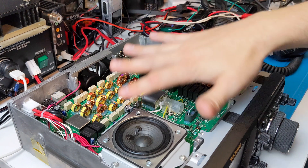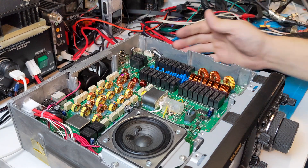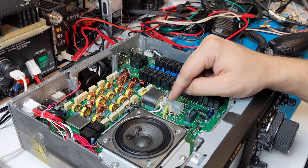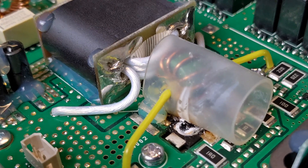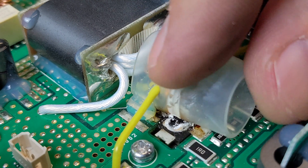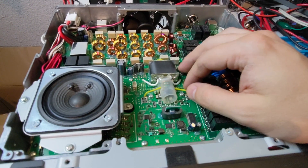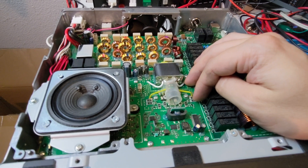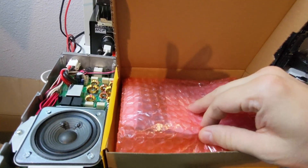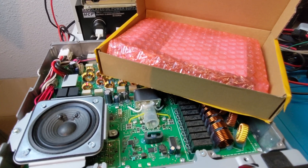I was super excited, started buttoning this thing back up, and just as I was about to put the lid on and go test it, I noticed the oh-so-familiar stain that is a part that's giving up the ghost. Right here, this big boy, which does all the work for our transmitting, has popped. It's like a big old MOSFET underneath here. Let me get a close-up of this thing. Next step is going to be to remove some of these components so we can get at that MOSFET and yank it out. We'll take a look at the thermal interface, and see if the part I ordered from China is genuine enough to get this thing back into service.